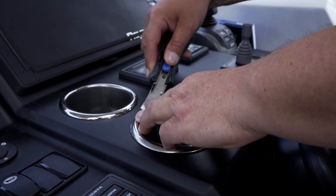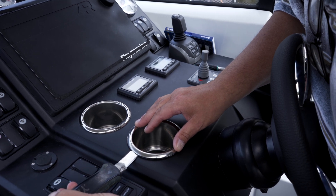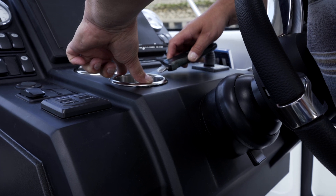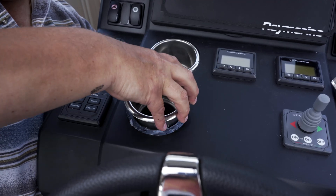The first step is to start with the installation of the Raymarine P70RS Autopilot Control Unit. To do this, we make use of an existing hole in the cockpit console, which is currently fitted with a cup holder. This is glued in place, so we carefully separate the glue with a sharp Stanley knife and push the holder out of the console from underneath.